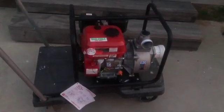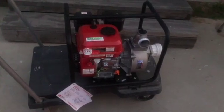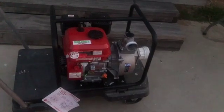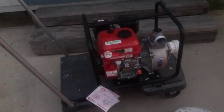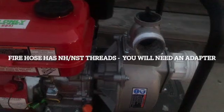I want to tell you a little bit about this two and a half horsepower Harbor Freight Predator trash pump for pumping water. It supposedly puts out 158 gallons a minute, it's two and a half horsepower, it has a two inch national pipe thread output, and I believe it's about $280 right now at Harbor Freight.